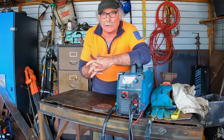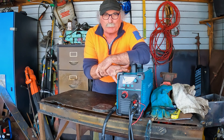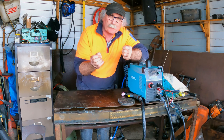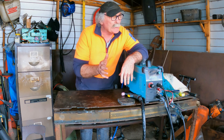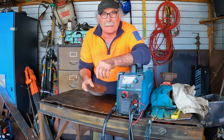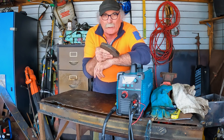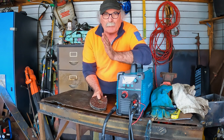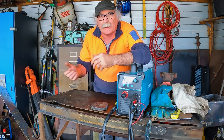Now, I don't know if you guys have got the same trouble as me, but I've been using a 65 amp single phase plasma cutter lately, and what I've found is that I keep blowing the circuits in my workshop. That's really, really annoying, because when you go cut something — I'm cutting like 20 millimeters at the moment, just trying out these machines — and when you go and cut something this thick, you're right in the middle of your cut, and then boof, everything goes out. The lights go out, the compressor goes out, and all the rest of it.